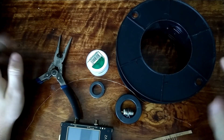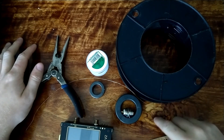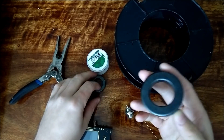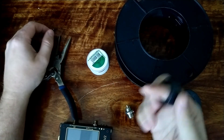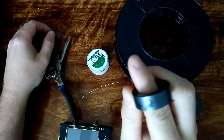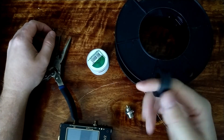Hello everyone. I'm going to build some antennas today, but first I want to make a balun. I have a few options - we have the FT240-43, and this is probably what you'll get from Jaycar. I think it's an FT140, and it's not type 43, although this one is - I did buy it online, but L15 is close enough where it shouldn't be a problem.